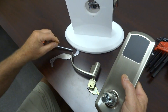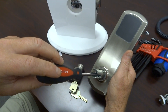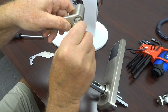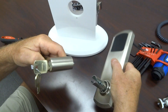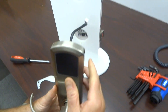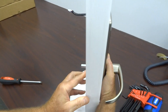Next, I'm going to put the outside lever on the outside. You rotate with a flat blade screwdriver about 90 degrees clockwise. You take your lever and rotate about 90 degrees clockwise on this also. Then you can slip the lever onto the lock body. So that's on, and we can install the outside front onto the door.